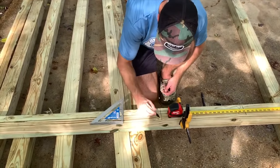You want to try to seal up all the screw heads and the voids and the gaps between the plywood now so it doesn't introduce issues when you go to apply the epoxy later. So here's a quick look at the crack filler after it dried. And once we were okay with how everything looked, I applied some painter's tape to the bottom of the wall